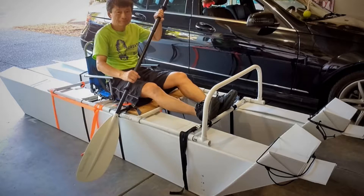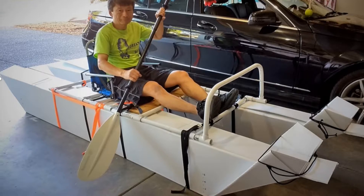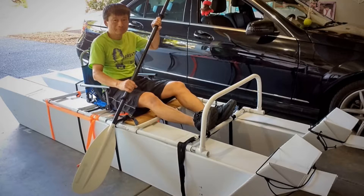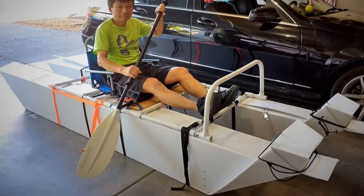This particular chair also has a metal frame. I use zip ties to tie it down onto the frame. I add another cross member here to act as a foot rest, and this also helps when someone is trying to get into the boat — you can hold onto this one, or you can hold onto the frame of the chair, which is very stable. I add a piece of wood because when I first climb onto the boat I need somewhere to step on. You can always step onto the pontoon. You put a lashing all the way from underneath the pontoon back. You can also create a single frame about four feet long — in that case I would suggest putting three lashings on one side, so a total of six, which will cost less and be faster to assemble.